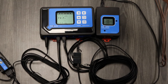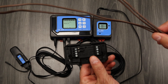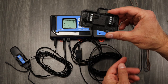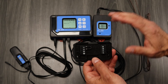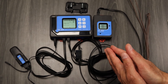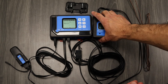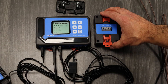What we're going to need is our terminal block and some thermostat wire. This thermostat wire shown is a short length and does not represent what you'll actually use — you'll use a length that satisfies the distance from the dehumidifier to the HS1 module. The Trollmaster wire connection is a simple two-wire connection to our controller — one of the simplest connections I know of. We're going to turn over the Trollmaster HS1 module.